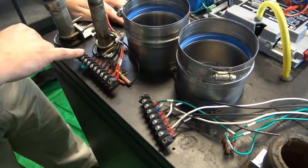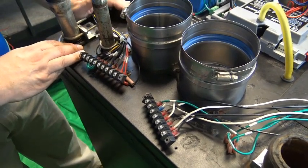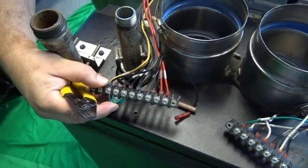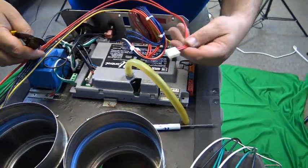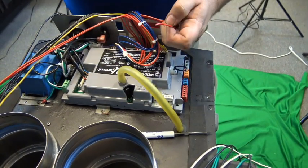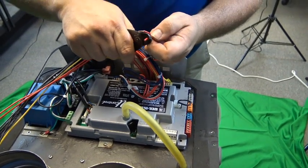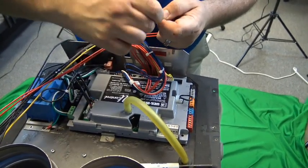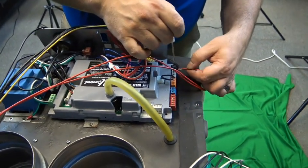You will follow along until each wire is put in place on the U-Control as it shows in the wiring diagram. The two most inside wires are your outdoor temperature sensor. The red wires here — we will follow them and come around to the connector, which we will then cut off and set aside. We can trim the wires, twist them, and bring them into your P10 terminals.